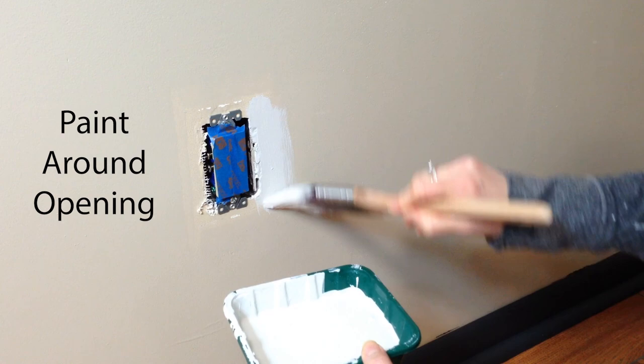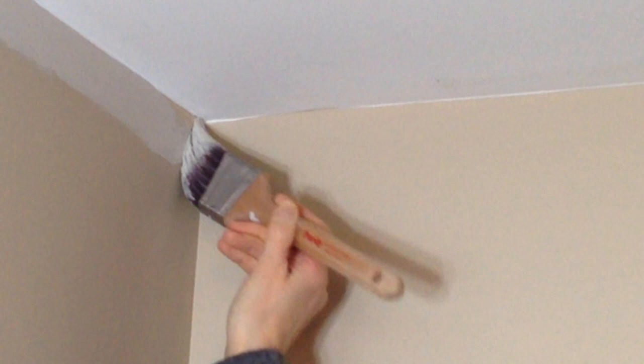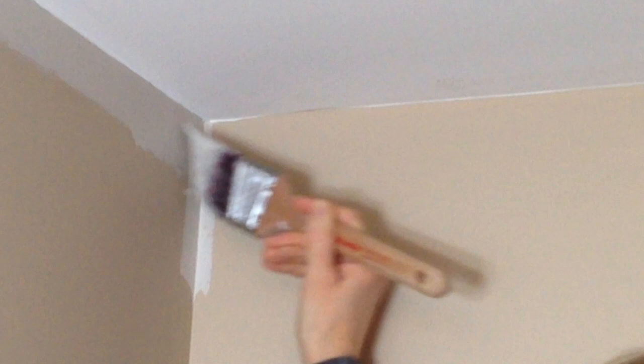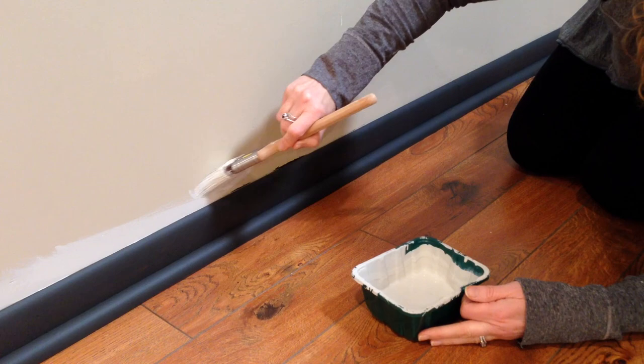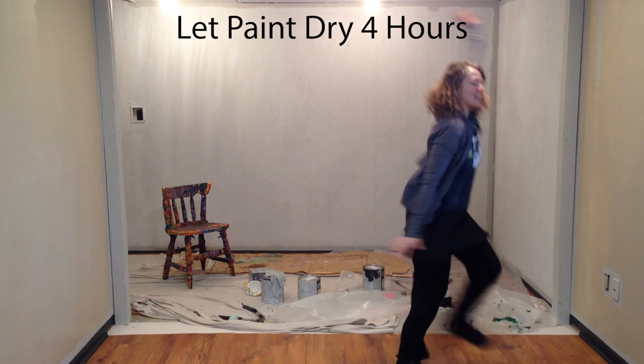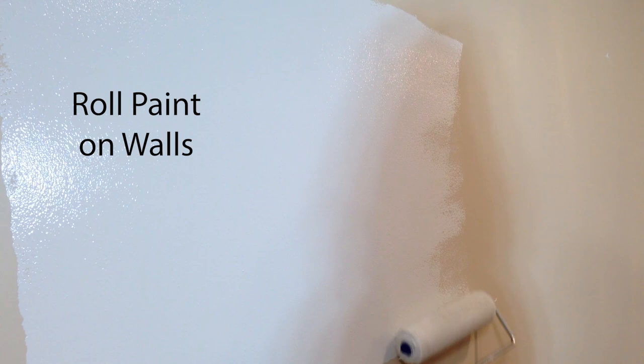Using the wall color, I'll paint a border around the openings. Next, I'm going to paint the edges of all of the walls — starting by painting across where the wall meets the ceiling and then going down the corners where the two walls meet. Then once the trim is completely dry, I'll paint close to it, going down the edge where the doors are and also painting across the woodwork near the floor. Once that edge paint has dried for about four hours, I'll go ahead and put a second coat on.